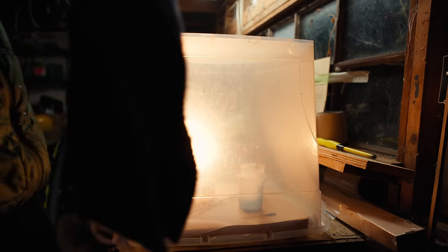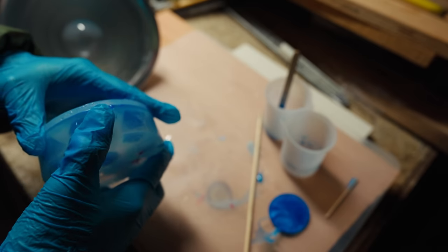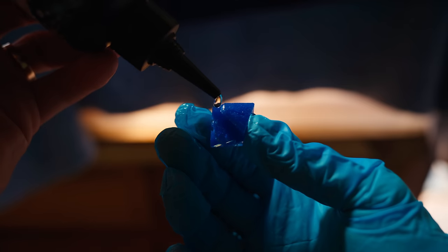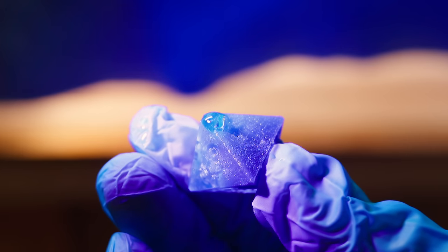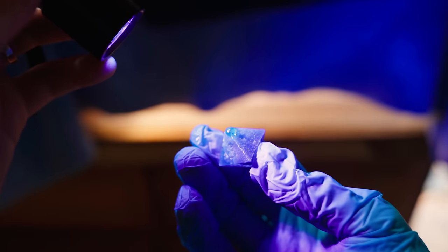Put the lid on your heat box, get your towels on there, and wait 24 hours for the resin to cure. Then comes the most exciting — and potentially most disappointing — part: crack your mold open and see how they turned out. If there aren't any large holes, you can move on to sanding and polishing. If there are holes, you might be able to fix them with UV resin, which cures in just a few minutes under UV light from the sun or a UV flashlight.